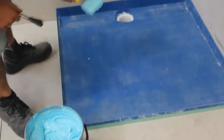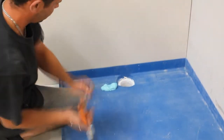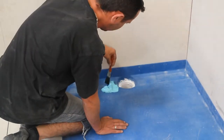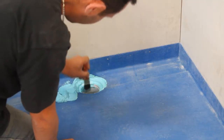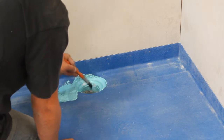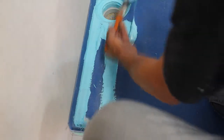The blue tileable shower base can be waterproofed over using many and varied types of waterproofing. Please refer to the extensive list found in the Acura base fitting kit. Apply the waterproofing down to the bottom of the internal thread in the waste fitting.